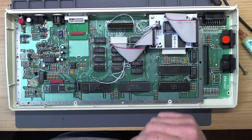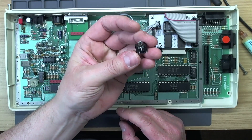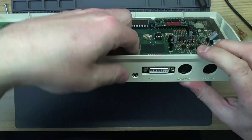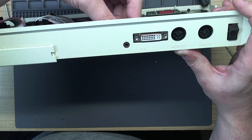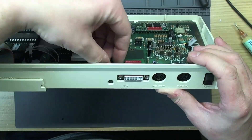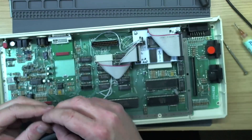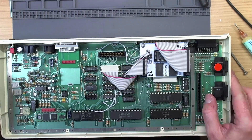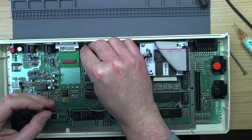One connector finally — and it looks just as neat from the inside as it does from the outside, so it's really starting to take shape now. I've also got the board-mounted audio jack which is going to sit here — lovely. I'm going to have to glue it in upside down because there's a lot of traces under there. It'll be sitting on a little bit of glue so it should just float up to the correct height. What I'd normally do is drill holes and put all the pins through, but there's such a lot going on there — I'm disinclined because there's going to be a lot of jumpers to solder.